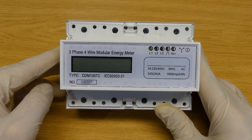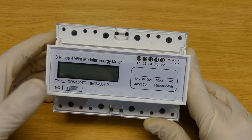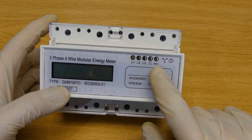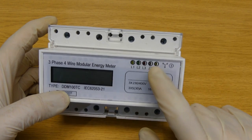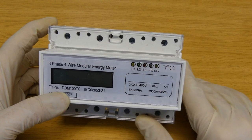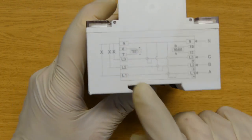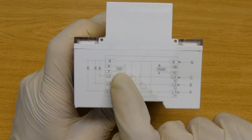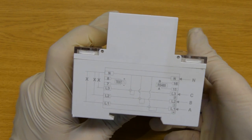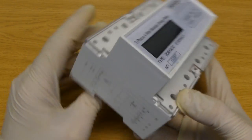Using the display, a human can see how much energy we've used, but I wanted to log it somewhere on a computer. We also have the pulse output — we know that we have 1600 impulses per kilowatt hour, so just by counting the pulses we can calculate how much energy we used. To make this machine-readable, you can put a light sensor on the LED and just count the pulses. I also chose this electricity meter because on pins seven and eight we have the pulse output, which corresponds to the pulse we see on the LED, with plus and minus. This way it's easy to connect it to a microcontroller directly and read digital signals out of this electricity meter.